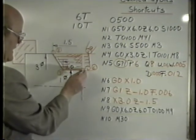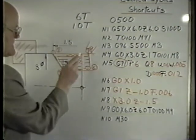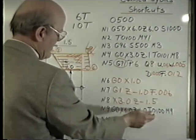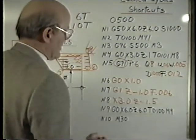And when it's all done, it will take a semi-finish cut across here, wrap it back to here, and we're sitting right there at the end of this number 8 right here. Then we wrap it back to where we came from, take out our tool offset, shut off our coolant, end of our program.